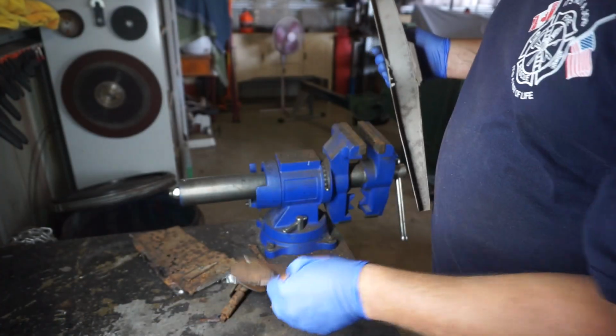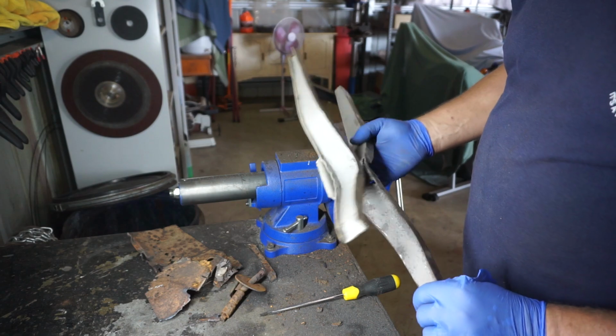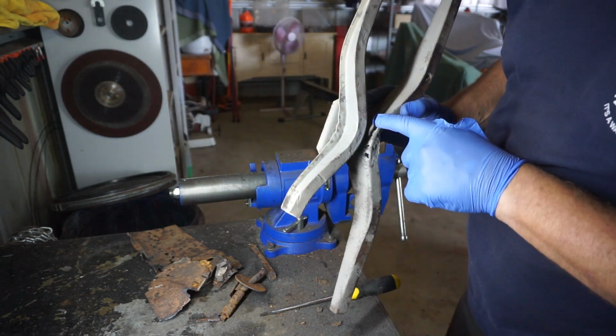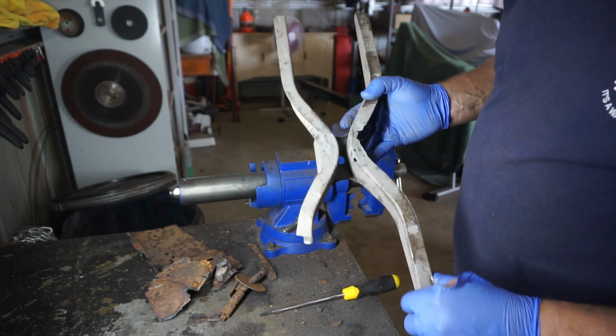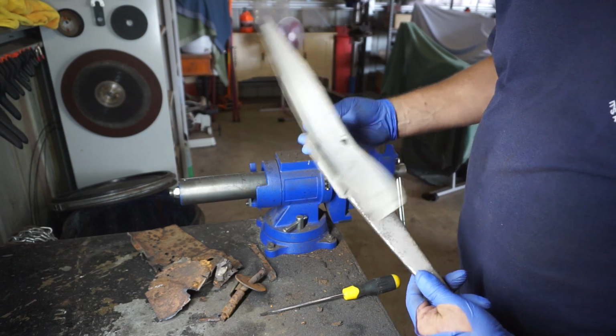Alright, I got all the crusty metal taken off this brace. I put it in the cabinet and blasted it. Now I've got some rust here, and on the shoulder, and on this flat. So that's the next step, to cut these bits of cancer out and weld those up with some fresh metal. But other than that, she's in pretty good nick.